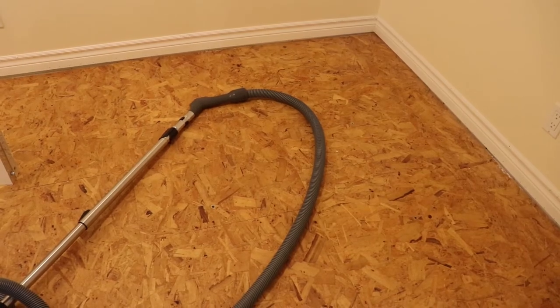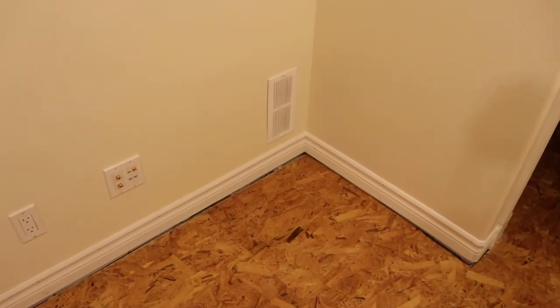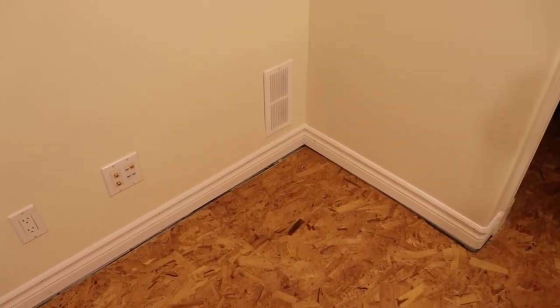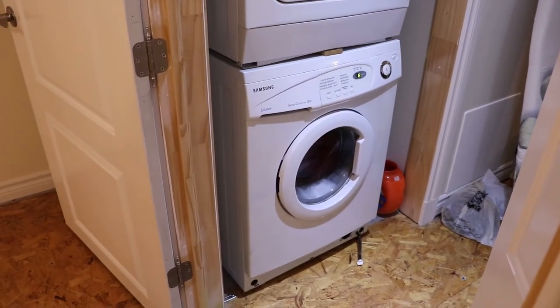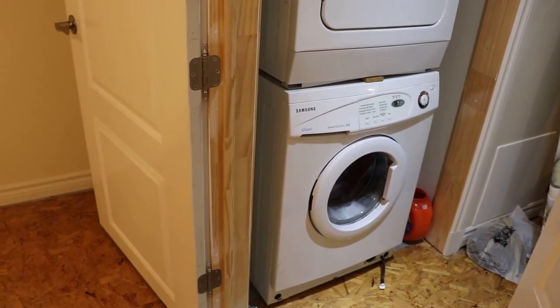It also makes the basement a lot warmer — when I put this in, I noticed right away that it wasn't a cold basement anymore. Another thing I did to improve airflow was put a cold air return into the furnace, as close to the floor as possible — there's a six inch round duct there so it draws the cold air off the floor into the furnace. And I've got a number of vents in various parts of the house, so this worked out pretty good. There's this laundry room down here in the basement and there's another laundry room on the second floor that we don't use, so these machines are just stacked here. Things are working away — hopefully you find this useful, thank you for watching.